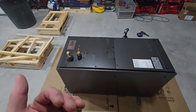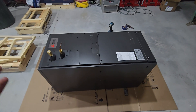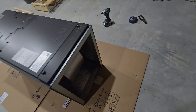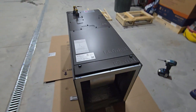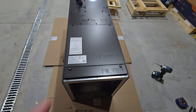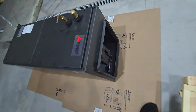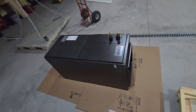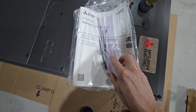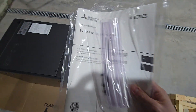For the unit blowing to the right, I believe I only need to pull the coil out — the drip tray is already in the right position. I need to attach the hoses that come with it, which is where the water flows down into the drip tray. You have to cut these hoses to a specific length; the directions tell you exactly what to do.